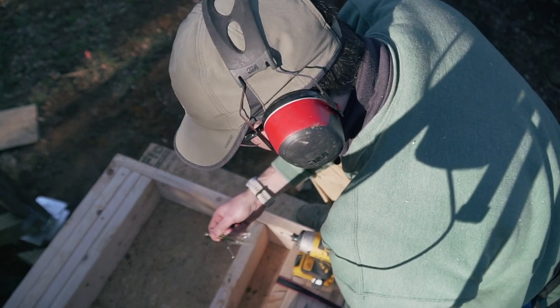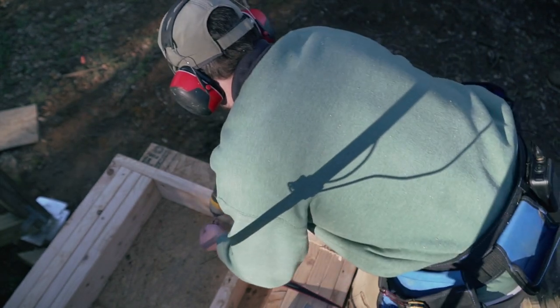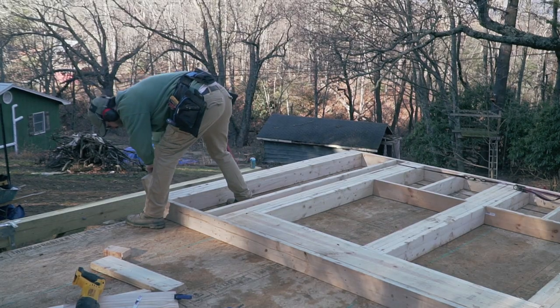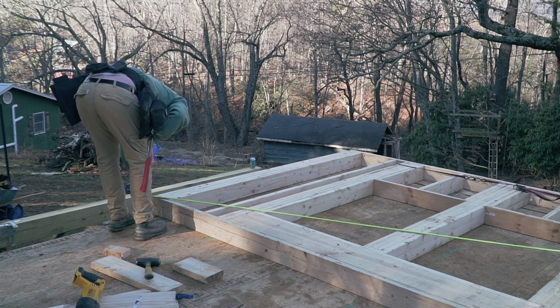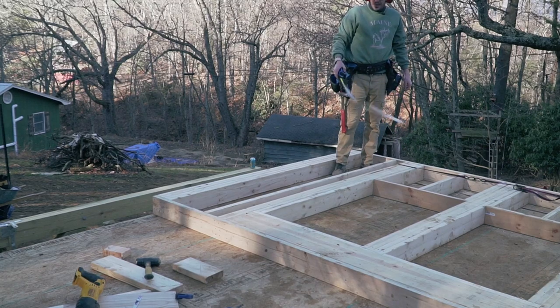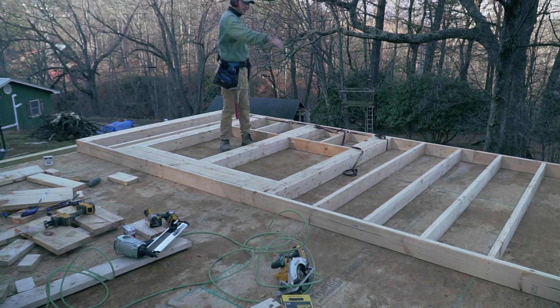That wind is cold — so cold. I just put a little angle bracket here and another one here. I need to move the top part while the bottom stays exactly where it needs to be. Checking my measurements: 236 and 3/4... 236 and a half. We're really close now — let's get it perfect. Banged it a few times, checked my diagonals, and now I have exactly the same diagonal measurements on both ends. Second top plate goes on.